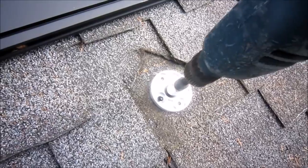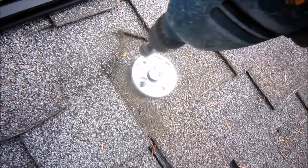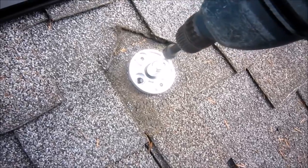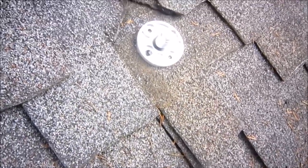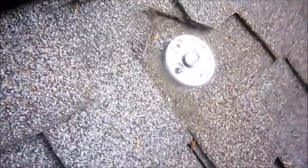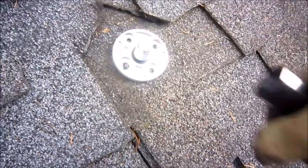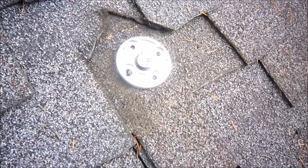You can feel the drill forcing at the end there — that's important. You can see you've got all sorts of good sealant in there, so you're creating a nice sealed patch. Right now, because this is just all one piece of metal, the only place where water could get in is way up here, and you're going to cover that completely with this really deep socket that goes on top. But first, we need to tuck the flashing in there. This is a nice waterproof system — they've done well, no complaints. I'm pretty happy with it and confident I won't have any problems with it in the future.